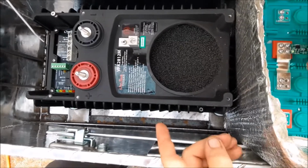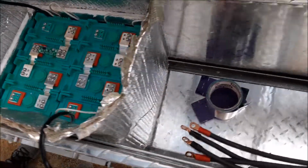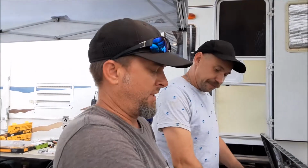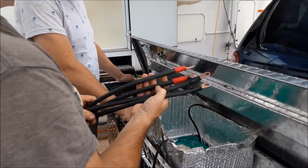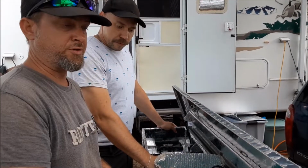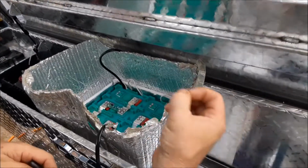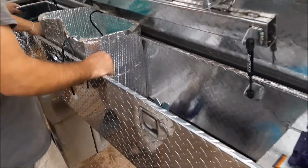We've coupled up with the Outback VFX 2812, which is the mobile unit, and it's a really good unit. The next thing we'll be doing is installing our balance boards, then tightening this all up and installing our cables. You can see the size of the cables we're using. Big boys. Each one of these cables is going to deliver power, so we're planning on being able to use a lot of power. We always oversize. It's better to go a little bigger. You're saving pennies to give a customer a better quality product. This is a high performance unit.